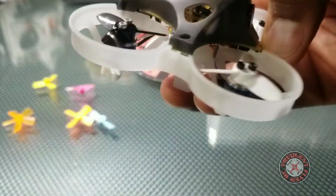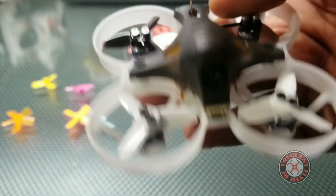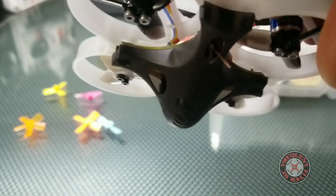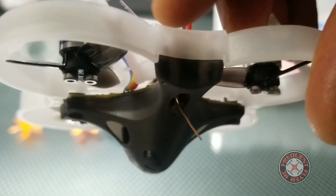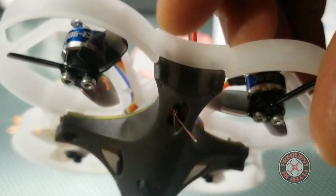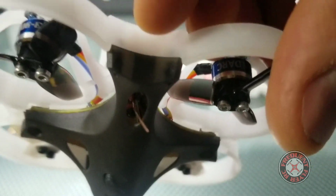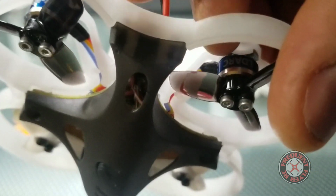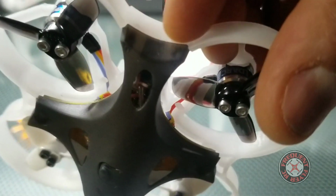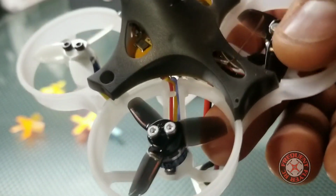You can plug it up into Betaflight and make sure that all the switches and everything are working. You can program your modes, switch them around and all, and it's really an awesome little quad. It has an LED right here that can be configured, so you can program this LED in the back here. It's already programmed though. It flashes red if you don't have a signal. It flashes green when you're running out of battery and all. When your battery is reaching LVC, it starts to flash faster. And it's solid when you have a solid connection and the battery isn't being pulled or anything.